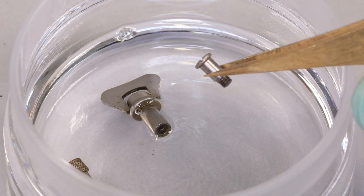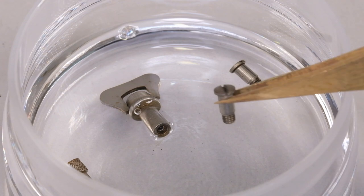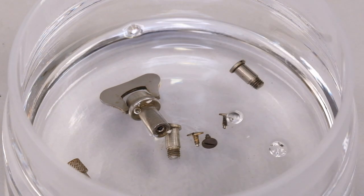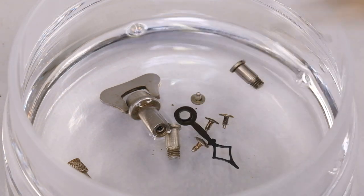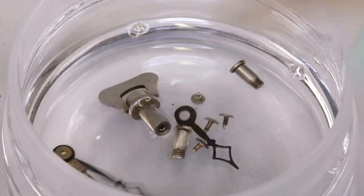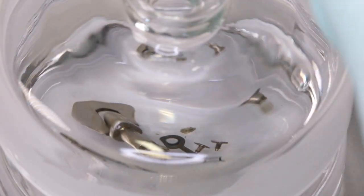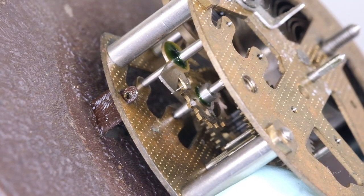So all the parts in this clock I'm going to wash and then rinse mechanically or manually in a proprietary watch rinsing solution. I'll put a link to that in the description below. So the cleaning you'll see later is with a natural bristle brush and the traditional method of pegging out the holes to clean the components. So we have our components soaking, which will begin to loosen up some of that old oil that we see.